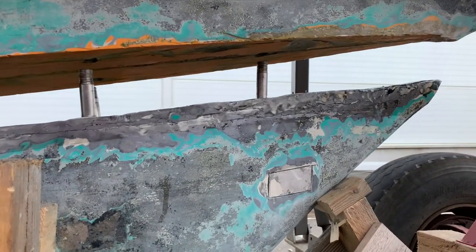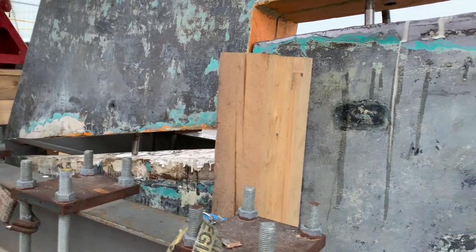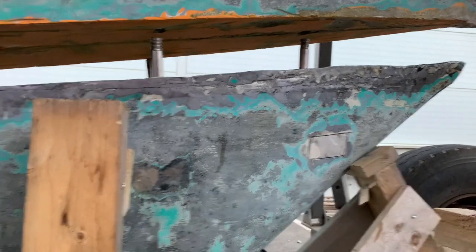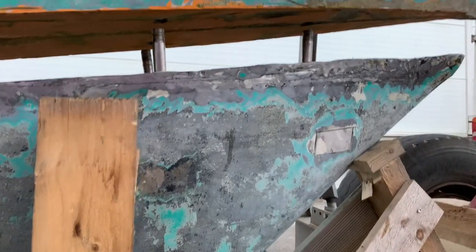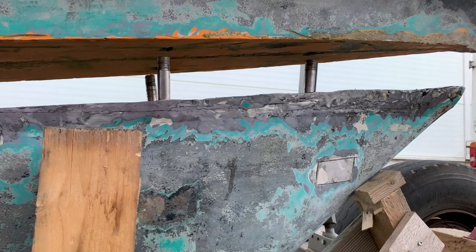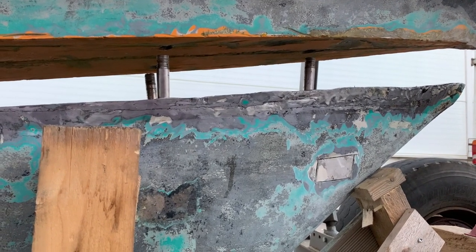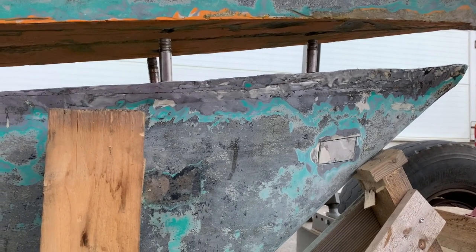The second option would be that, what it looks to me, the first and the rearmost keel bolt are at the same angle. So if I could remove the other bolts, then I can just later fit them back when the keel is in place. Then I can put the bolts back from inside the hull.